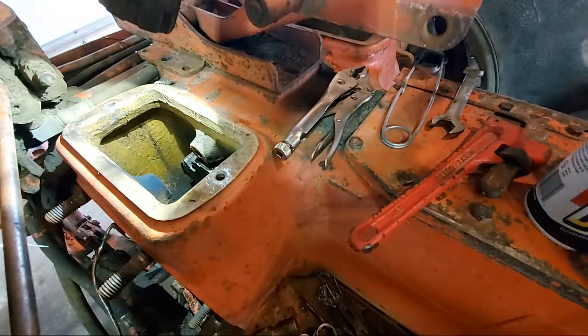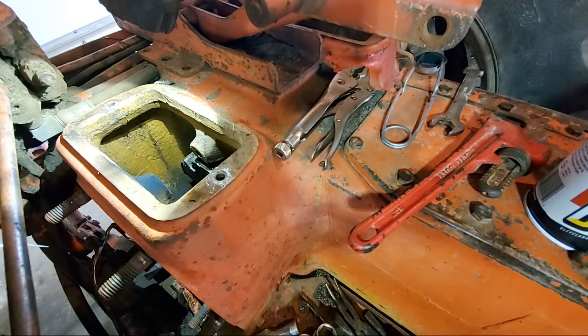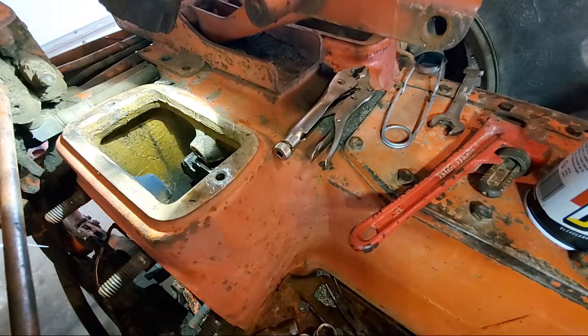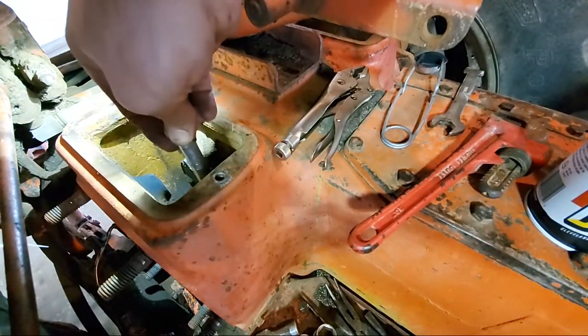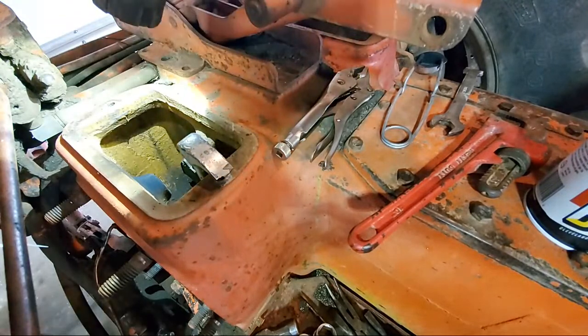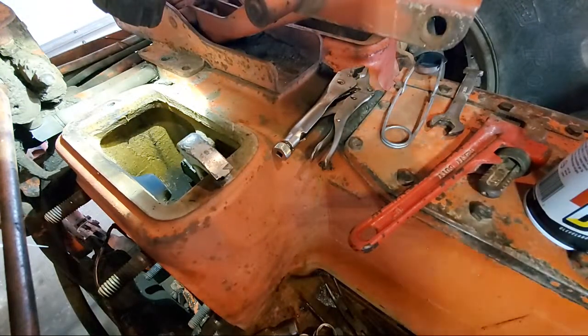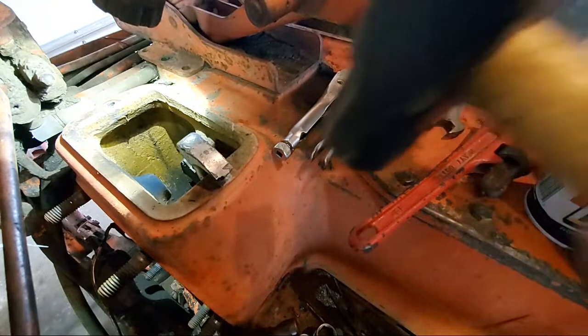I've done this numerous times. This by far isn't my first rodeo on these. The first time I did it, there were multiple times where I was just convinced there's no way I can do this, you know. And I had the torch at that point. I just wasn't utilizing it correctly and didn't have a lot of money the first time. Well, I didn't have any money, honestly. The first time I was lucky to be getting pads for the darn thing. So I was trying to save everything that I could, and I finally ended up just cutting it out anyhow and going over to the machine shop and getting some 1045 rod. It's a 7/16 rod. I didn't want to use the Chinesium stuff from the local mart.